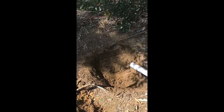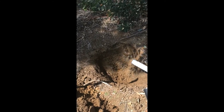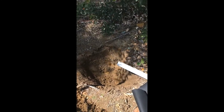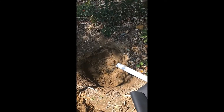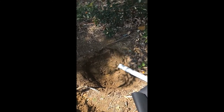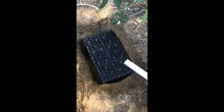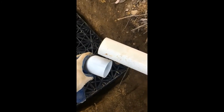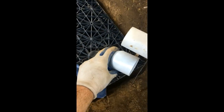There's going to be gravel on the base of the hole and on the sides. If you Google it there are plenty of videos explaining how to dig it and how much gravel to put in. The washing machine water is going to go into the crate, soak out through the crate, through the fabric, through the gravel, and out into the ground — out of sight, out of mind, and no smell. I have a 45-degree elbow and I want to cut the pipe about here in order to get it to shoot down into the crate.